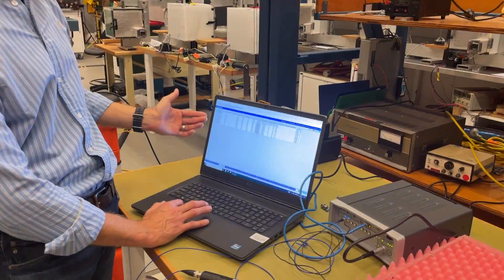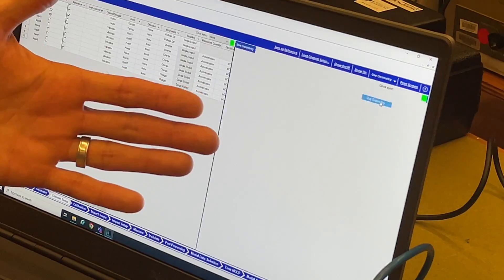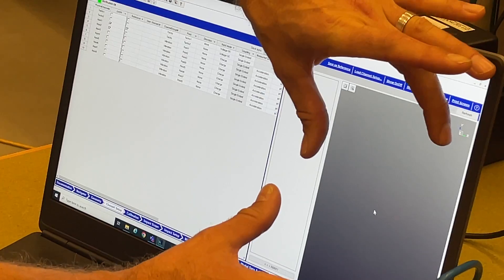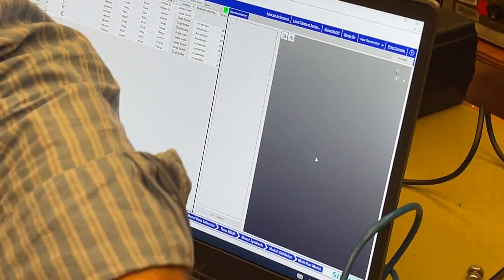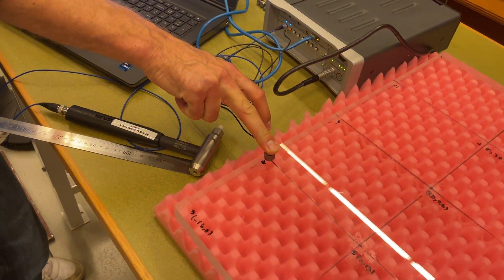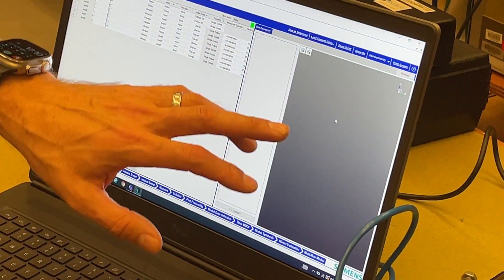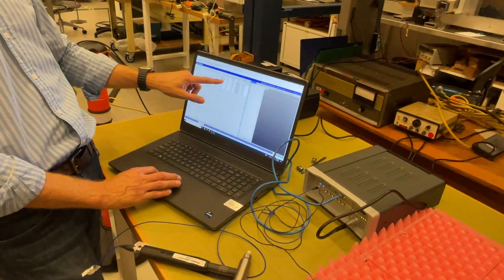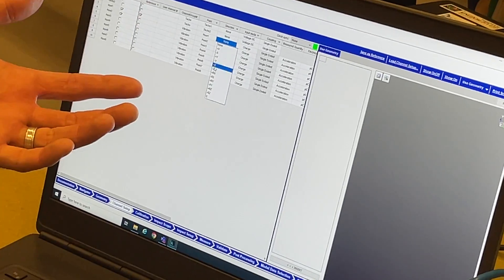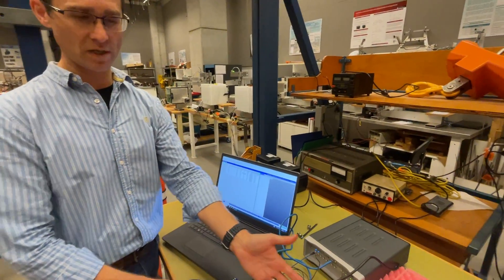Then we're going to come to the channel setup sheet. This is pretty important because what we do with modal impact channel setup is use it in conjunction with our geometry. If I'd built the geometry, I'd have a wireframe representation of my plexiglass plate with nodes named accordingly — plate colon one, plate colon two, plate colon three, and so on. I would say I'm going to put my accelerometer at plate colon four and start impacting at plate colon one. I'd highlight those nodes and associate them with channels in my channel setup. I also need to define the direction — just z or minus z, depending on whether my transducer is mounted on the top or bottom surface.